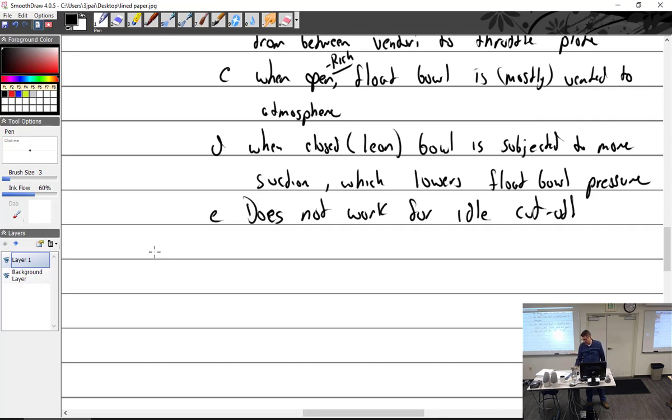In all honesty, you could do idle mixture that way too. Turn off the fuel at the tank and just wait and wait. Eventually, if the mixture is right, you'll see the RPM tick up a little bit and then die as you run out of fuel. I tried it once and I lost patience at about 3 minutes into it. Naturally what's going to happen is you're going to be waiting and waiting, your watch will beep or something, you look, oh, it died, and you're like, shit, I missed it. And I've got to start all over again. So you've got to turn the valve back on, drain the fuel, get in the carburetor, prime it, go.